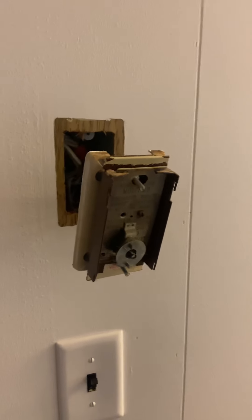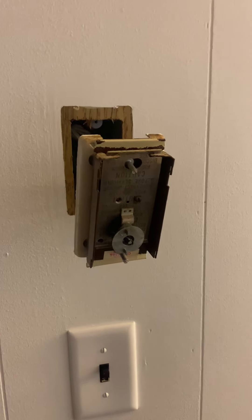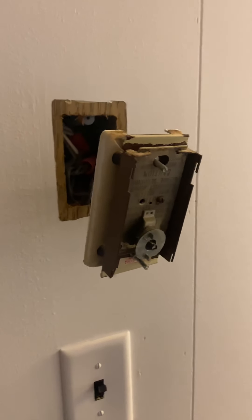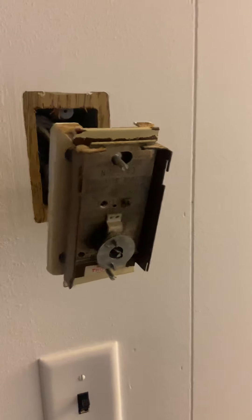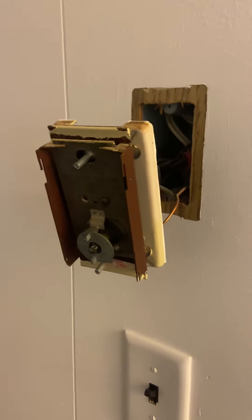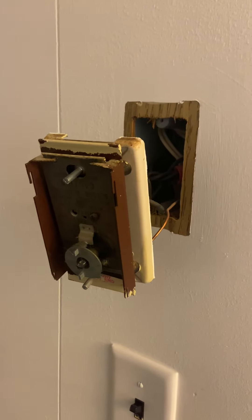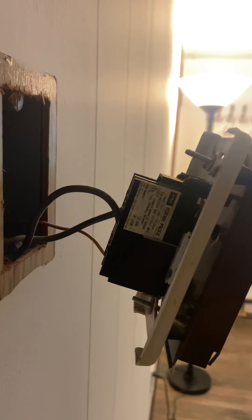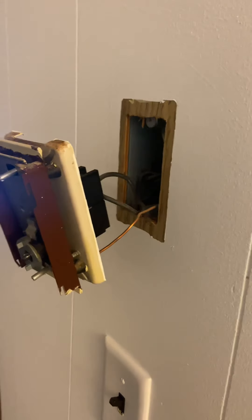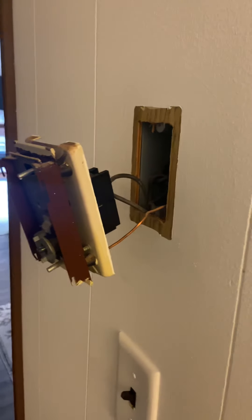In this video I'm going to show you how I switch out a mechanical thermostat for an electric baseboard heater. The first thing you need to know is whether it's 120 volts or 240 volts, and the other thing you need to determine is whether it's a two-wire or four-wire connection — sometimes that's called a single pole or double pole connection. Don't get confused with the single and double pole breaker.